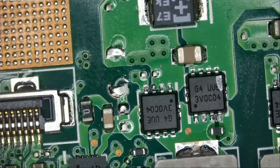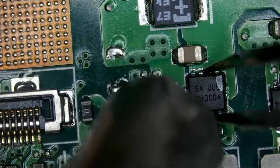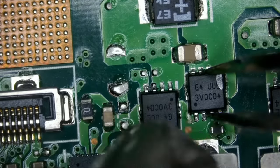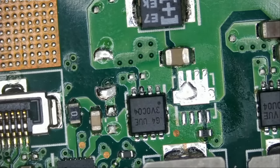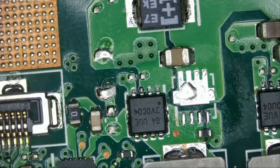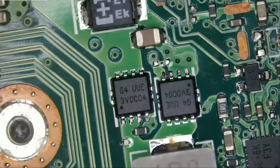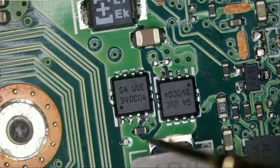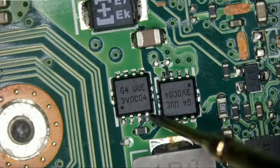Let's go ahead and remove it — one ohm on a gate is not normal. Let's measure the gate now. Look at that — now I'm reading 10K, not one ohm. But I'm reading 10 kilo ohms. And what about the one that was reading 70 ohms? Is that related in any way? I have no idea — we are still reading 74-75 ohms.